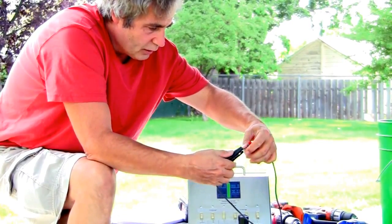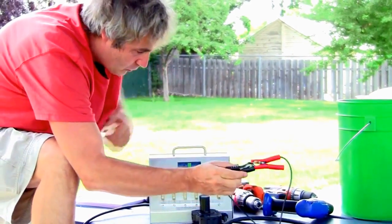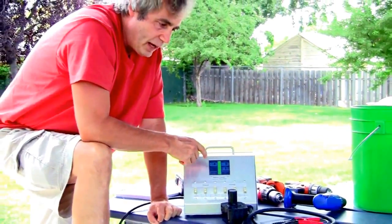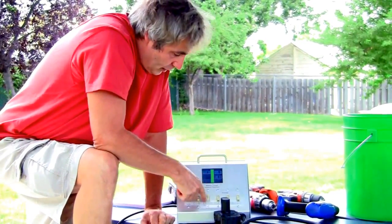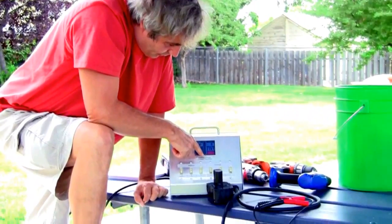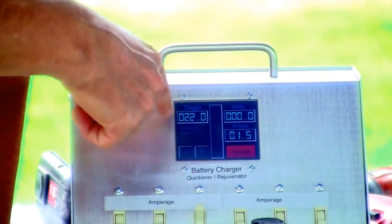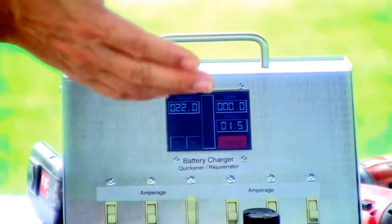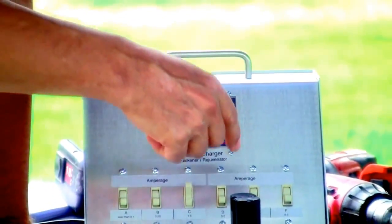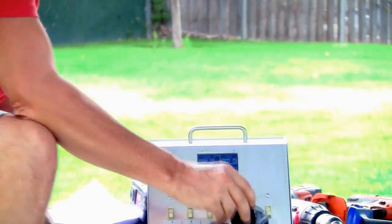Now we're going to clip the leads together — I'll show you that this thing can be short-circuited and still works just fine. We're going to short circuit it right now, which means you're charging a really heavy capacitor or something, like a multi-farad capacitor — the new super caps, they call them. We've got the setting the same and we're going to hit start. It's at zero volts, and you notice there's nothing on the amps, but it's showing 1.5 amps coming out. Target's still 22. So that'll charge up a capacitor — you can leave it like that all day long, doesn't hurt a thing. It's current limited and the voltage depends on the load, which in this case is no load. You can't do that with any other charger right now. We hit stop, cancel.